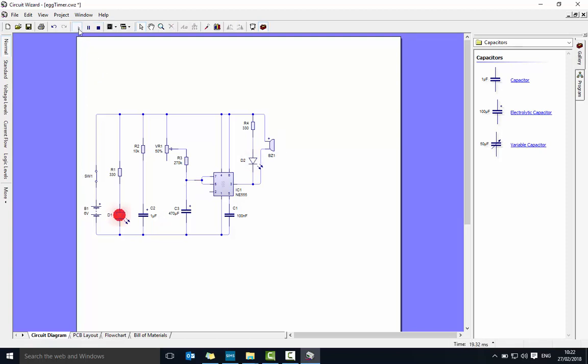If I push play you should see the LED goes, and depending on the percentage, mine just beeps. The other LED should go as well if left long enough. Now I've got the circuit complete. Do make sure you change all the values and double-check that the numbers match up, including units — don't mix up nano farads with micro farads.